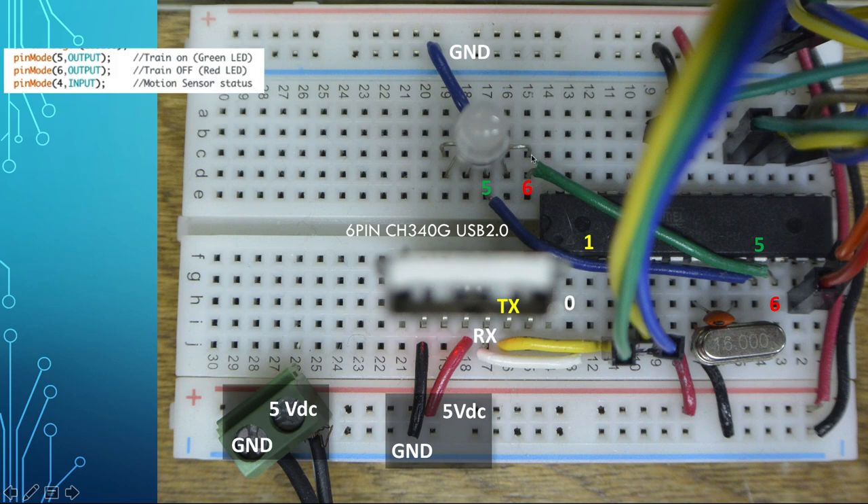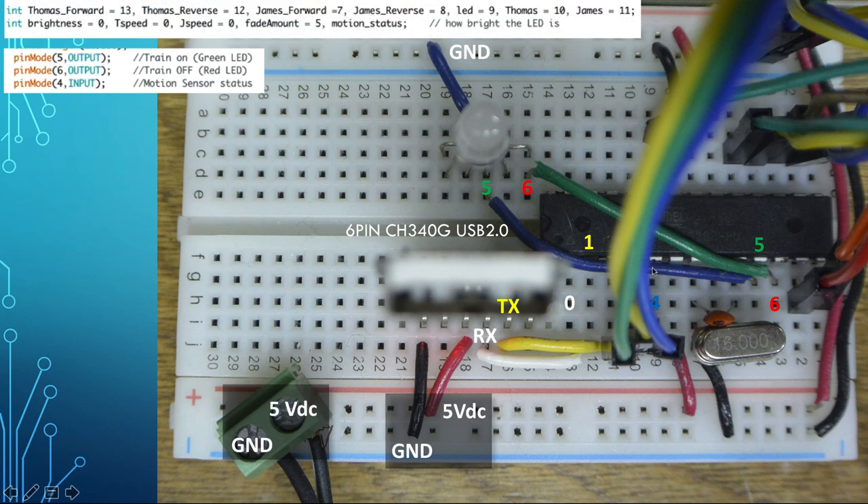For the red color you will burn the LED, so I do use a resistor for that — a 110-ohm, which seems to work fine. So pin five is your green, pin six is your red, and then ground. Now pin number four is the only input we're using in this project — that's the motion sensor status. Whenever the infrared light from the motion sensor gets interrupted, that activates our software.